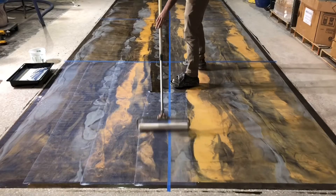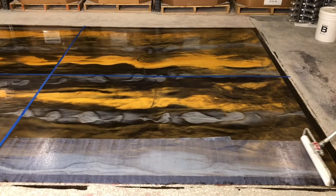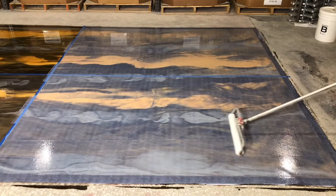The first topical sealer used was a water-based urethane. Being water-based, it leaves quite a bit of open time to be manipulated and cross-rolled, which helps avoid roller lines. It is a semi-gloss material with quite low odor. The drawback is about a two-day cure time before it can receive full traffic, and it has a 24-hour recoat window.